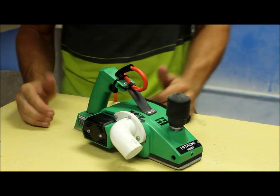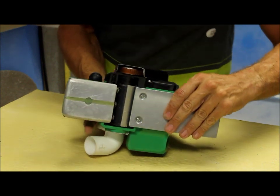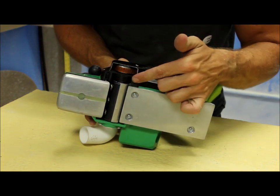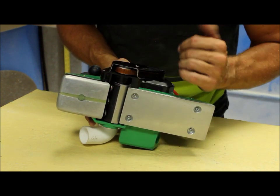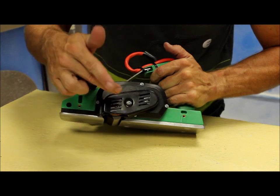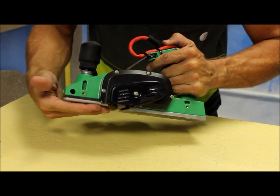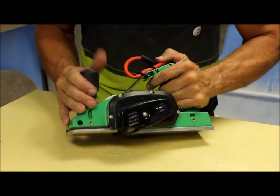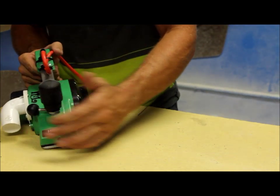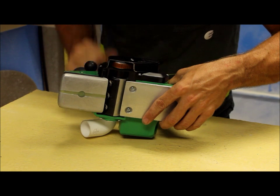Lastly on these planers — and sometimes you can do away with this, but I love it — on the back side here is the belt and the housing, which I've ground down a little bit. The stock housing and belt cover, what would happen is when you got this at a full cut with it fully open, there used to be a lip there and it would have the planer kind of cockeyed when you're working with it, and when you're pulling it back it would just be inconsistent.